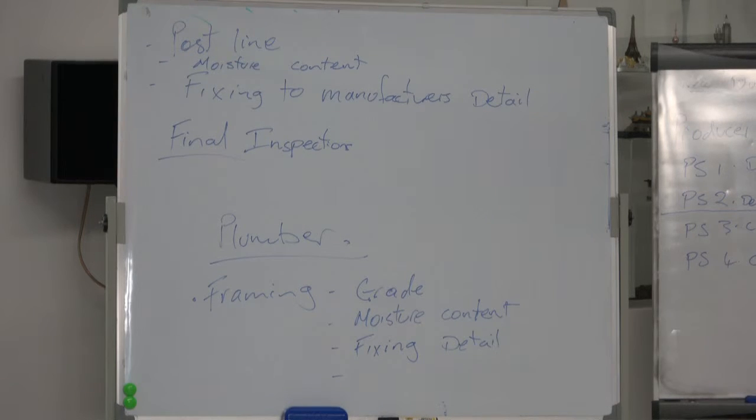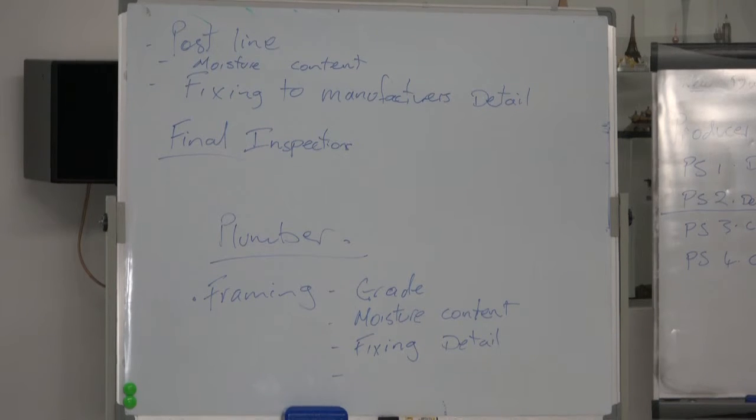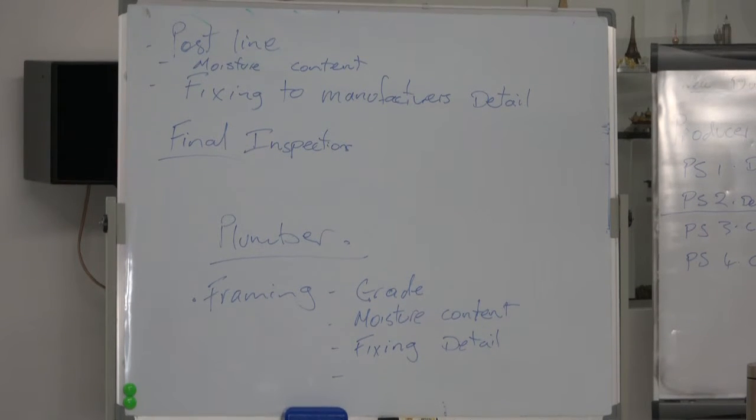He asked, before we submit the documents to the council, will they give us a list of what kind of documents we should submit? It should be on your conditions of the building consent, and you should try and do your own list. Yes, the council officer will have a list of things that he'll ask for. Be very careful of that, because some council officers will ask for things that are not on your building consent. And then you've got a heck of a job trying to provide something that actually was never required. Can we reject it? You can, he might not. Because once he's got it in his tablet, it's really hard to get rid of it.